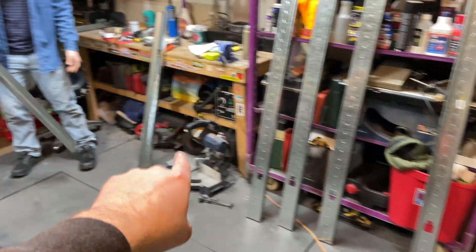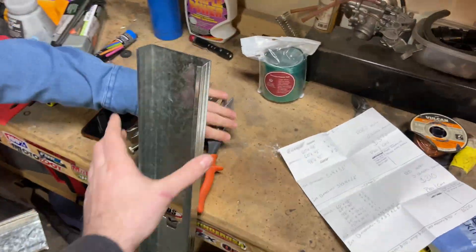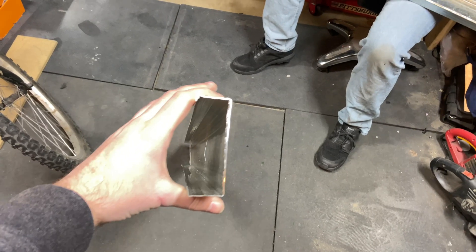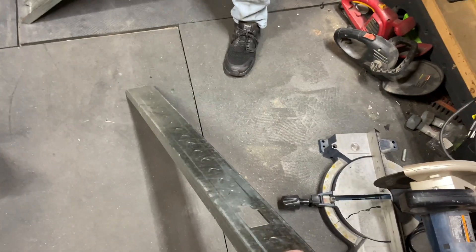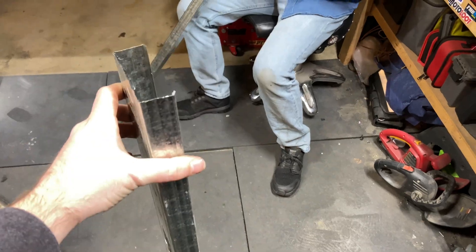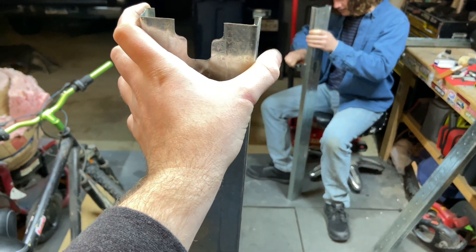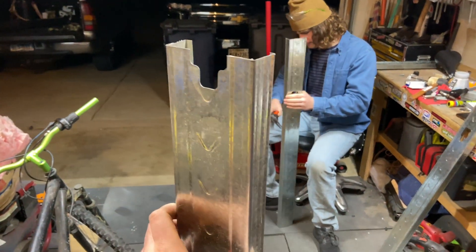These right here are five feet long; those two he's working on are four feet. If you want to save yourself trouble — if you don't have a metal brake, don't buy the studs that have a lip. They're a little more structurally sound, but you're going to have to crimp off that edge to fit over these flush. All said and done, these are going to be our vertical bracing. We'll have one strut across the bottom and one across the top, and we want it flush. With that lip it kind of rides out, but we want to be able to rivet it down nice and smooth so we can fit sheet metal right over it.